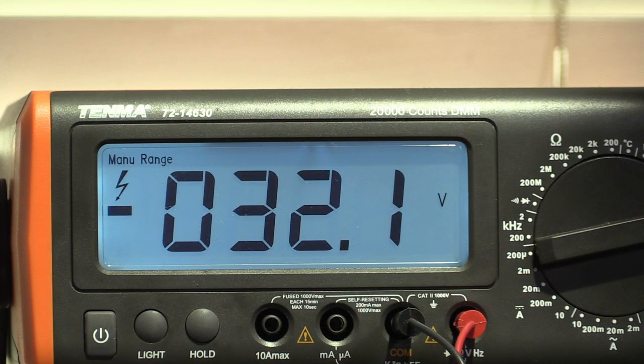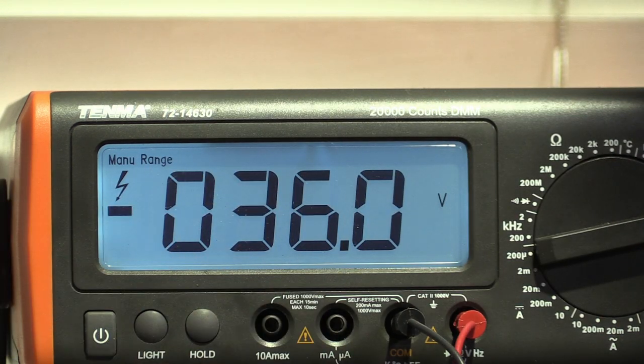I've been cleaning all the pots, including the bias pot. So I'm not sure where to put that bias pot. On the drawing, it's implying about minus 30, but we're going to start by running it at the coldest possible setting. So now I'm going to put in the tubes and we'll continue on with our analysis. I've now got a full complement of tubes in there. I've had to replace one of the preamp tubes that had a crack in it.